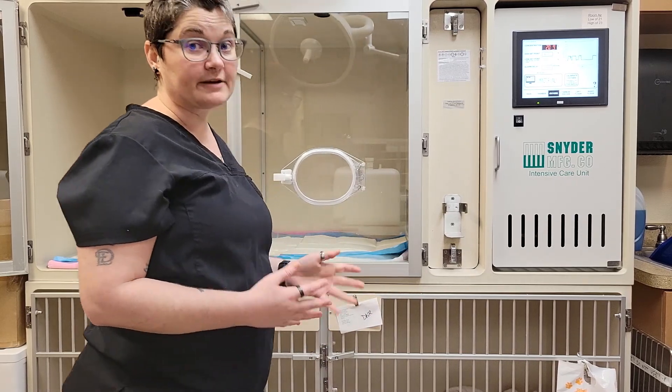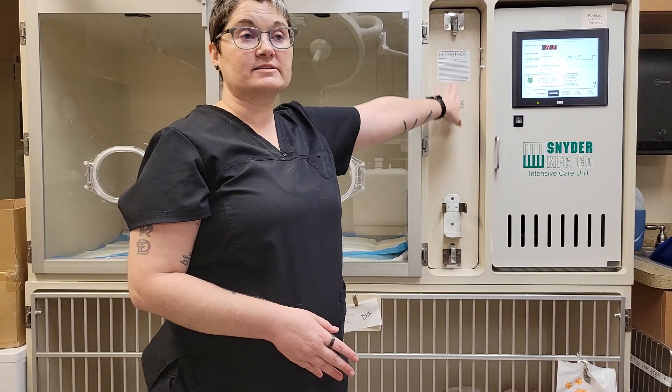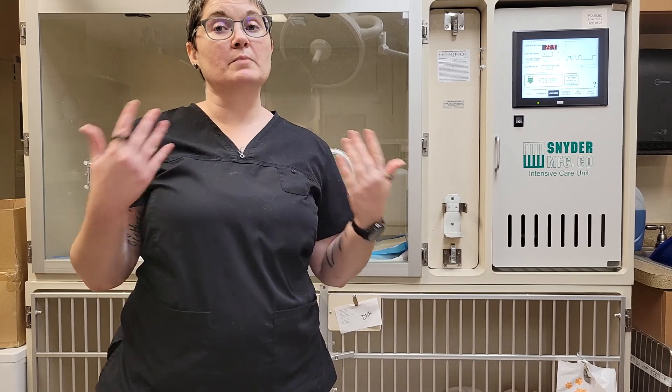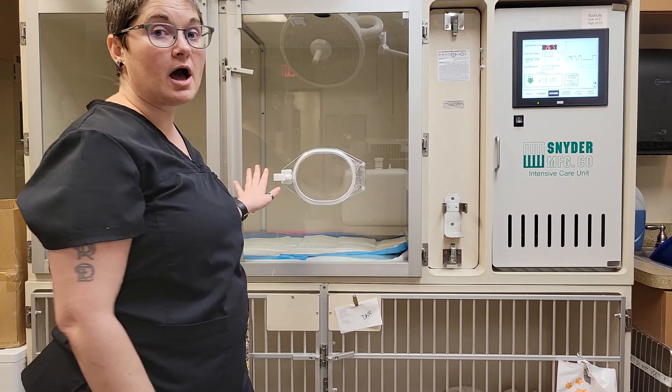The machine is now calibrated and ready for use. One thing to take into consideration: after you've hit that active output, it takes a minimum of eight minutes before this chamber will be at 40% oxygen. Some things that may cause it to be slower are too much condensation in the coil, expired soda lime, or clogged filters — all things that could potentially cause the oxygen concentration to not come up at a steady rate. It can take up to 20 minutes if the unit is not maintained properly. This is why we emptied and changed out everything in the B door compartment, so that within those eight minutes we can get our unit up to 40% oxygen.